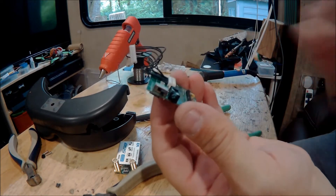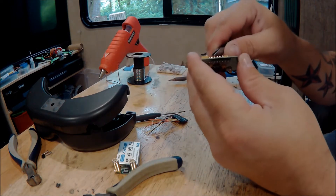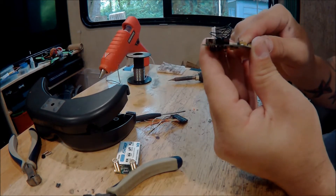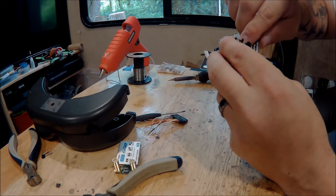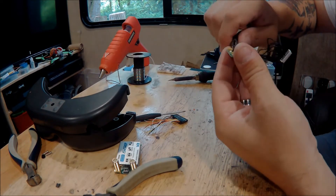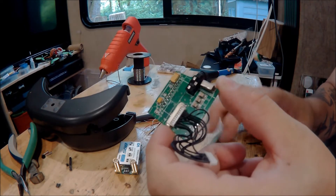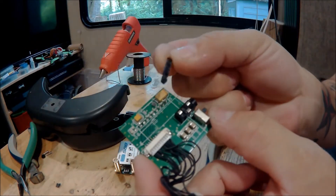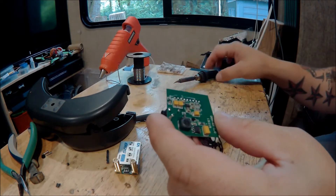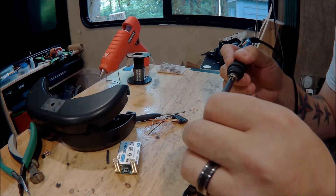Look at that — beautiful. My suggestion after this is to take the black plastic piece off carefully, lift and bring it back over those pins so it will go away and not be in your way. Then you can remove the pins with your preheated soldering iron. Now that I've got that stupid plastic piece off — which was a terrible job — you have to be really careful. Back to the preheated soldering iron; I'm going to take all these pins out now one by one.